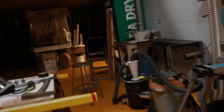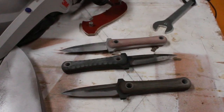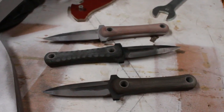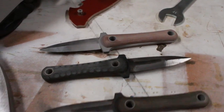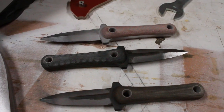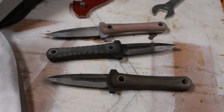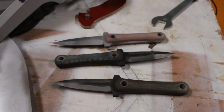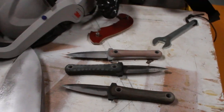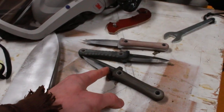We'll move on to a couple of nice little baby crow daggers which are about ready. I'm waiting to mount my water-cooled platen up to my KMG grinder after I get some rough grinding finished before I finish these up. I'm going to do longitudinal grinds on the blade bevel so that I don't have to hand sand them.